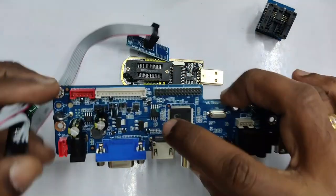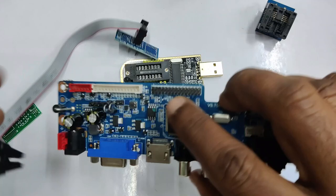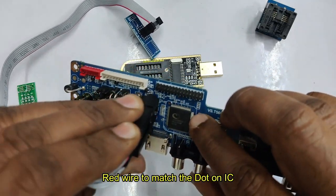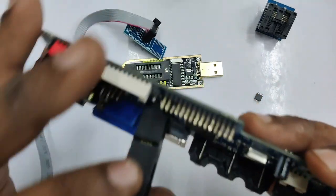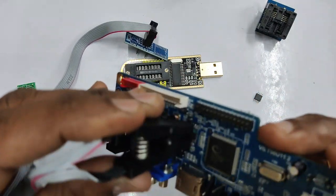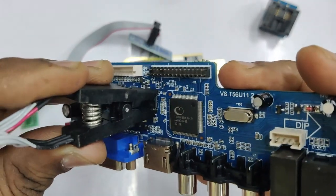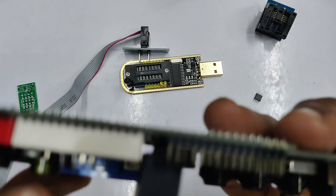The clip socket has a red wire. The red wire should always match the dot on pin 1 — the red wire is pin 1 and it should match the dot on the IC, which is also pin 1. You can easily clip the IC without removing it from the board.